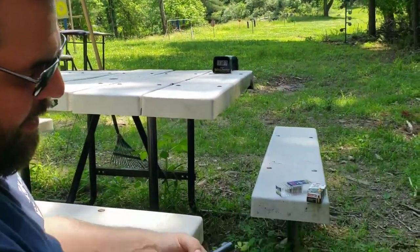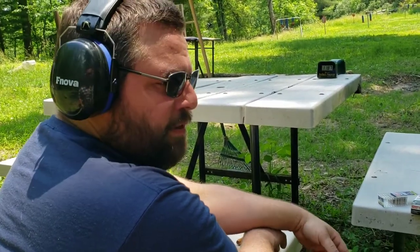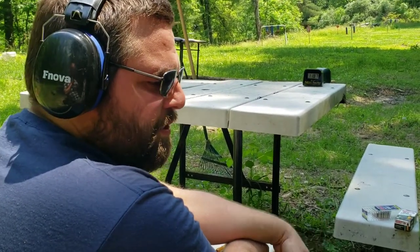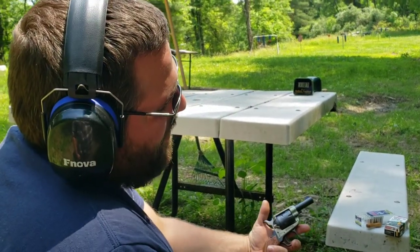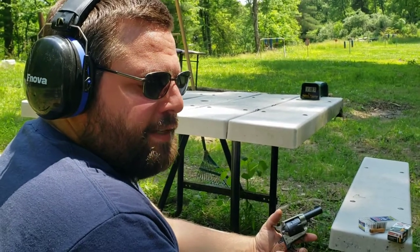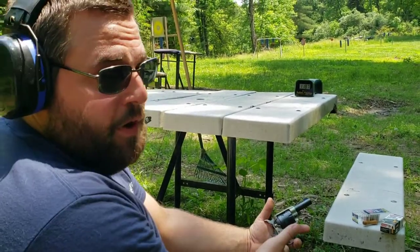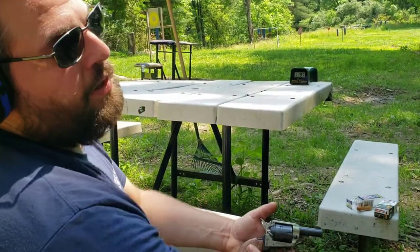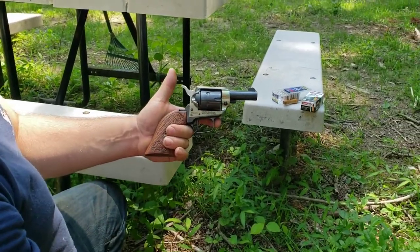Looking at the results — I don't remember the exact numbers from the previous video off the top of my head, but these don't seem much lower. I think we were hovering around 1,200 on a few of those last rounds in the other video with the shortest pistol barrels. It doesn't seem to suffer much, if any at all, going to this 2-inch barrel over the 4 and 5 inch barrels we tested previously. That's definitely not what I expected, but it's good news — dropping down to this shorter barrel, you're not really losing much more power with 22 LR.